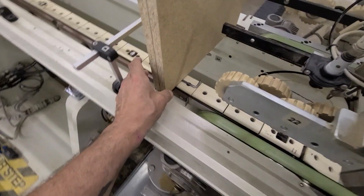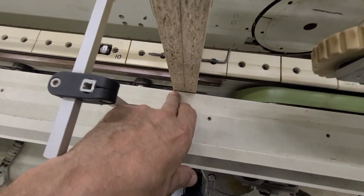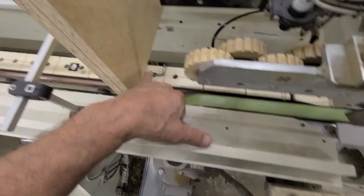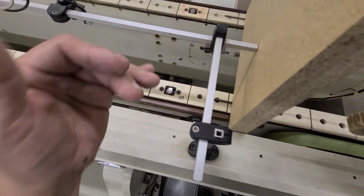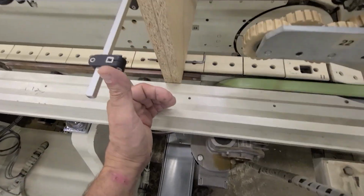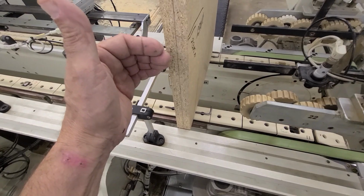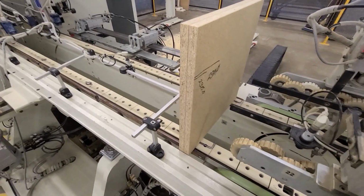I have now taken it and slid it back over here to the side where I'm pulled up against the same fence that I referenced. So the relationship of my keys is the same relationship as my dogs. Okay? And since I book matched them, brought everything to this side, now here's my error. Because I have book matched it, my error now becomes double.